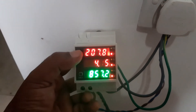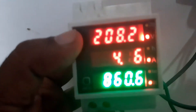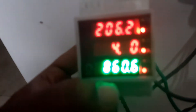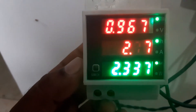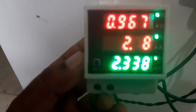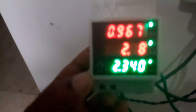The first screen shows at the top voltage 208V, then the ampere 4.6A, then 860 watts consumed at this moment. You can toggle between the two screens using this button. Now at the top it is showing the power factor 0.96, then the time 2 hours and 8 minutes so far it has been logging the data, then at the bottom it is showing the energy consumption so far — 2.3 kilowatt hours has been consumed.